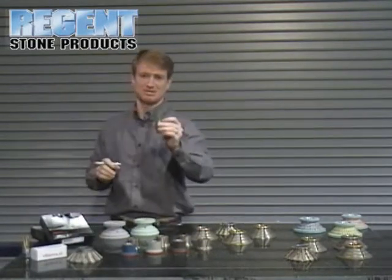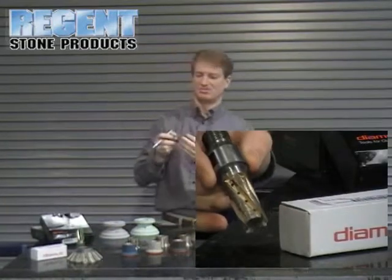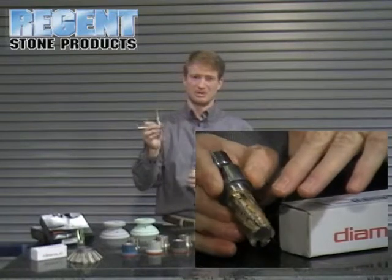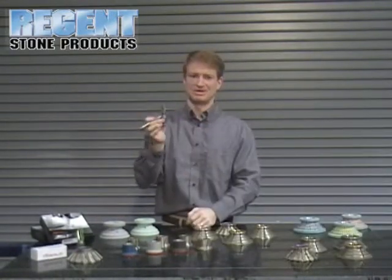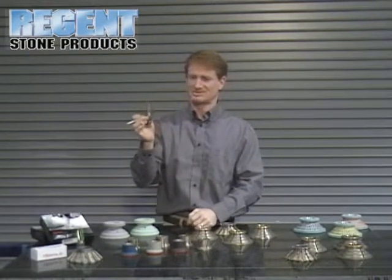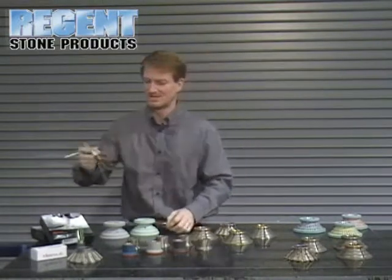It's a very good quality to have in a finger bit. This is a traditional speed finger bit. This here is the high speed finger bit with the same helical twist — it runs up to speeds of 40 inches a minute. Realistically on your soft to medium stones we'll run it at 30 to 35 inches a minute. It's an outstanding finger bit and our most popular.